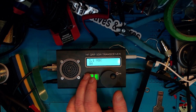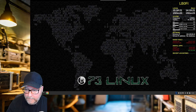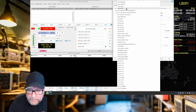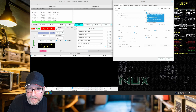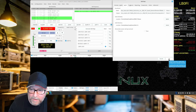Let's hop over to the computer side. We're going to start up WSJT-X and get that started. It gives me an error because there is no rig control, so we're going to reconfigure the radio interface. As radio, we're going to choose none, and we're going to have it PTT by VOX. Something's starting to happen — so something's working. On the audio tab, we just check that it is the right sound card selected, and yes it is. Press OK — those are all the settings you need to do here.